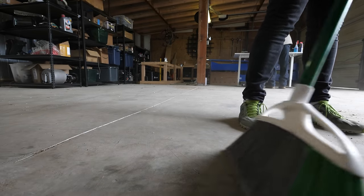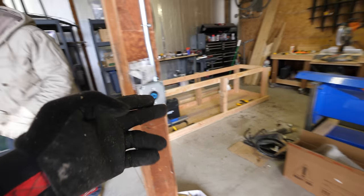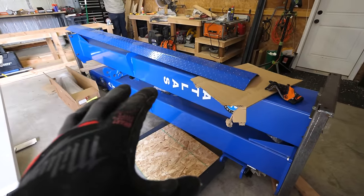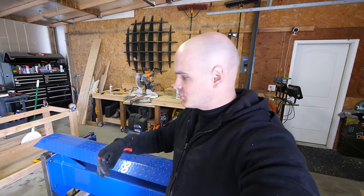There are a couple different kinds of lifts. I chose one that's a bit shorter to fit inside the garage space I have. In my particular scenario I'm not going to be using my lift every single day — it's mostly just a hobby project. Things to think about when getting a lift are: how tall the ceiling is, what kind of power you have. I had 220 wired into this post so we can tie the tower into that. As it gets shipped, this thing weighs a lot. There was no residential shipping option so I had to have it shipped to a port, then loaded onto a trailer and brought into my garage.